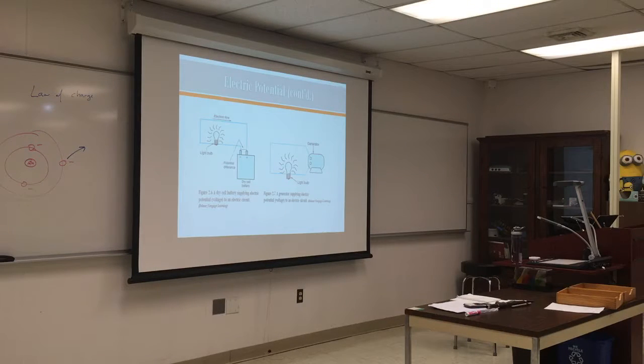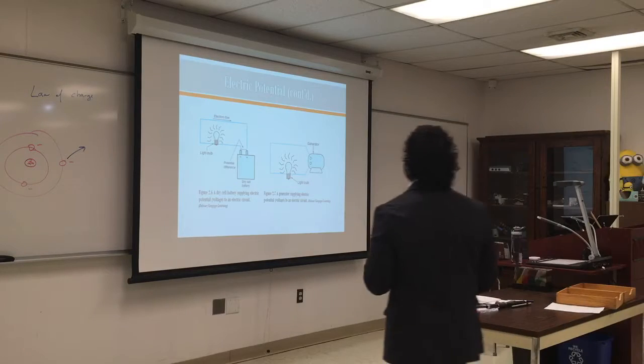We had this a few times in the lab. It was very, very frustrating. We checked everything. We're getting power at the equipment. We get power. Check your neutral. Check the complete circuit. Sometimes the neutral wire at the end is just loose, so you don't have a complete circuit.